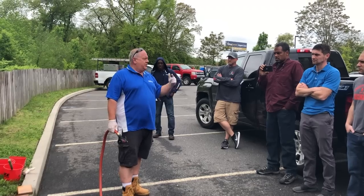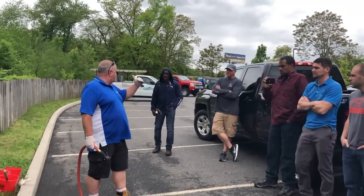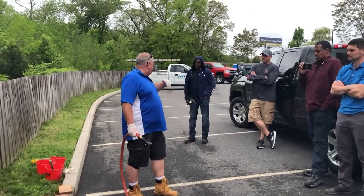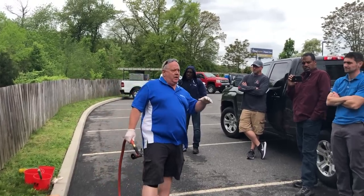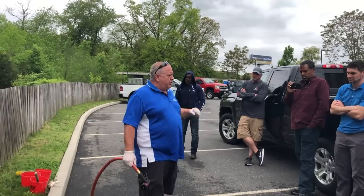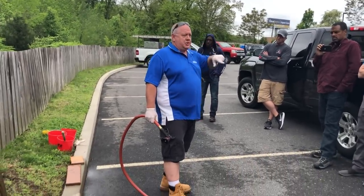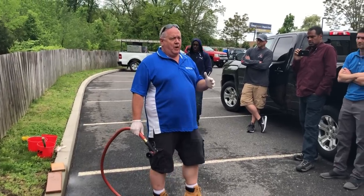And who mentioned the tough time with the acrylics? That was you. With the acrylics, what happens is they sit right on top. So when the dog scratches them or furniture scratches them, there's nothing there except wood. That's why we want a penetrating product, because when they move the furniture or the dog scrapes against it, you might see a scratch mark, but you still see the same color because it went in. Those will also wear away.